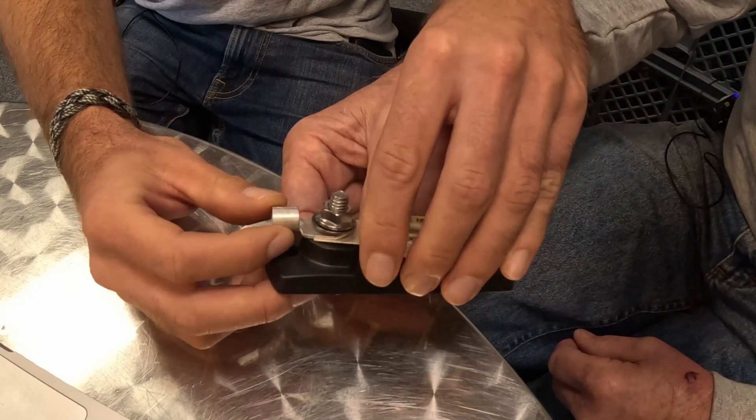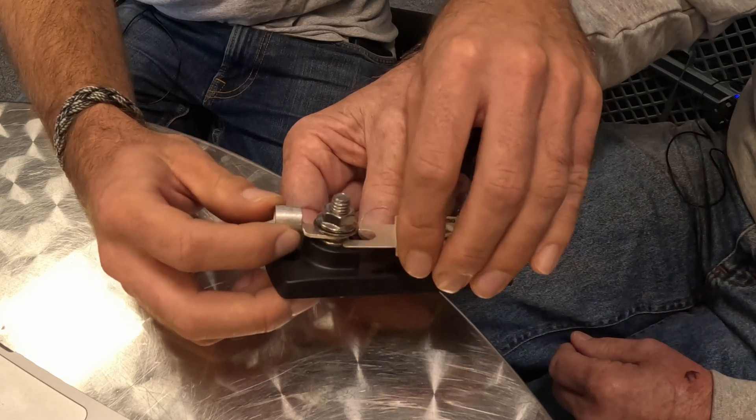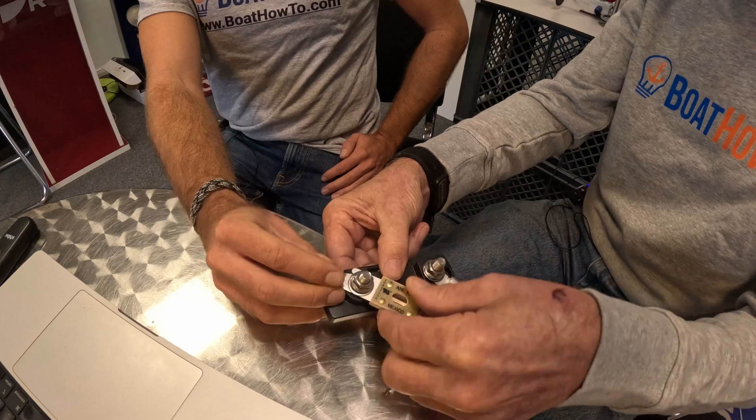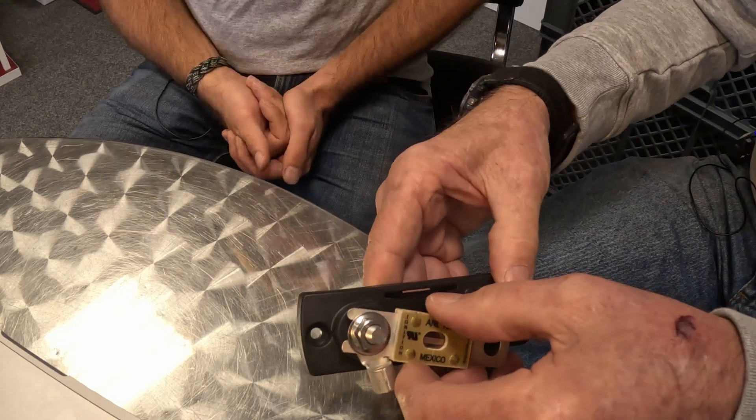To be clear, he also said he replaced the posts with brass — that's not actually necessary. It's totally fine to have posts, washers, and nuts made of stainless steel; that's actually a good option. Just make sure the fuse is in direct contact with the terminal — either on top or below — with no stainless steel washer in between them. The stainless is just holding things together and should not become part of the conducting circuit. Incidentally, brass has 28% the conductivity of copper — not that much better. If it's part of the conducting circuit, you need four times the mass to carry the current. The brass and stainless fasteners are just holding the two conducting surfaces against each other and must not become part of the circuit.